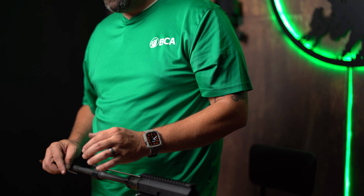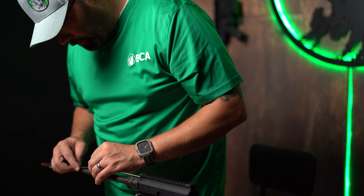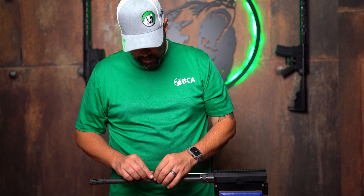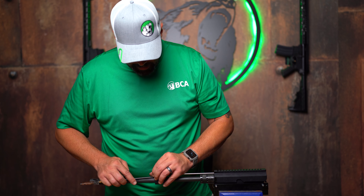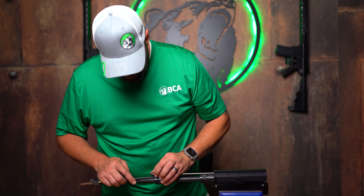Back it out until it clicks into that first spot. On the adjustment knob for this gas block there are notches — each one is an adjustment point, and you've got five of them on this gas block. When you first screw it in you'll be in that first adjustment. You'll also notice there's a slit in this bolt — that slit corresponds to the middle notch, and that's my recommended setting for your gas piston gas block. Screw it in flush to the block and it clicks into that first position; to adjust it, simply push in that pin, adjust it out, and when the pin is lined up with that groove in the front of the retainer bolt, you're set up and good to go.